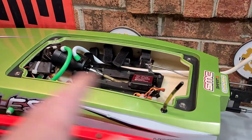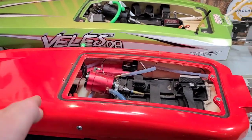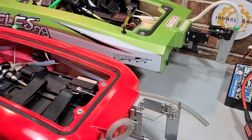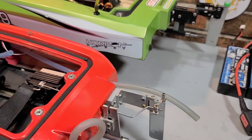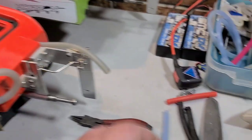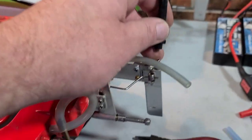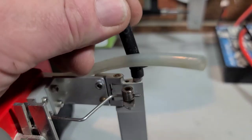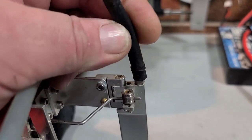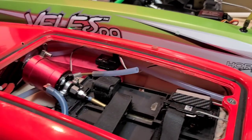This really only happens when you're making a boat go fast. This boat right here I've had up to about 95, and this one I've had up to 73 miles an hour — no flip. The faster it goes, the more pressure, the more odds of the lines blowing off. You can use a zip tie over your cooling line — it works, but it doesn't work all that great, it looks silly, and you've got these little zip ties all over your boat.